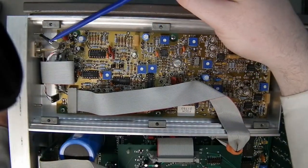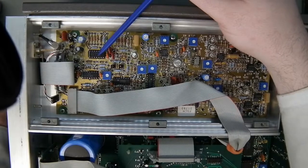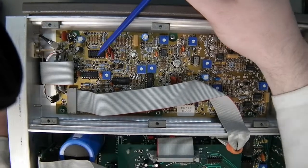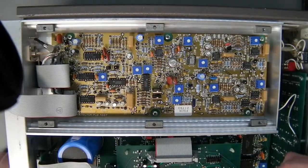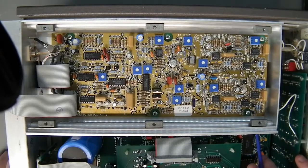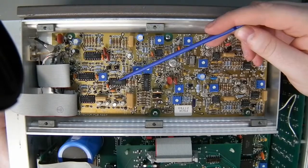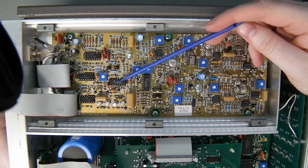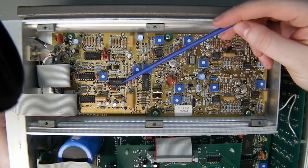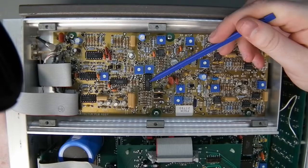We've got an SMC connector coming into the back here. Over here we've got a CA316E RCA H832. This is the detector PCB assembly — obviously the waveform detector, which is why it's all shielded. On the side it's written P111543 Revision A. There's a wee Motorola part, a TL084CDS — KKGF 8845. So that looks like the 45th week of 1988, which would make it quite a recent board.